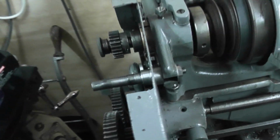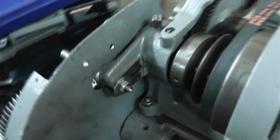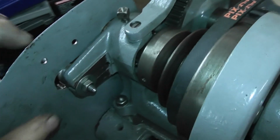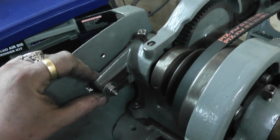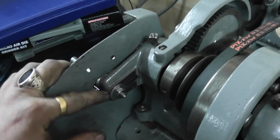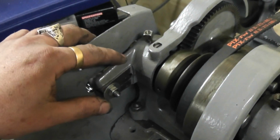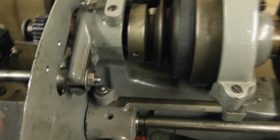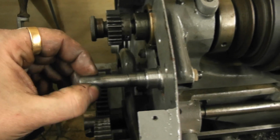Right, like I said, this is for any lathe really, so you'd have to modify it and design it for your own lathe type. But this one is a Myford M type long bed, a bit of a mess, got swarf all over the place, it's in use. With Myfords, this is the M type. I think the pre-M type, or pre-B type, sorry, has got these. The B type, I'm not sure. The M, and I think later versions, have got these as well, or in a different position. But the actual main gear of the tumbler reverse sits on this stud here.